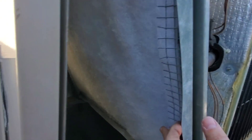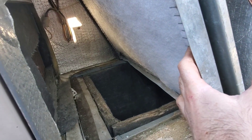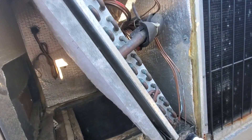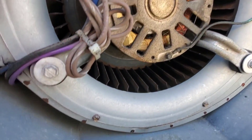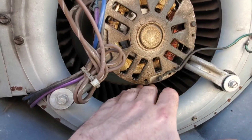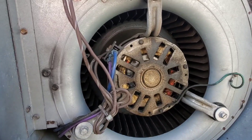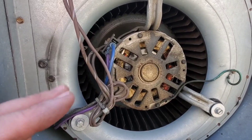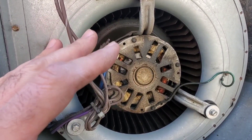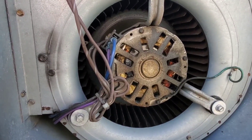Quick check on the filter — looks like it's been changed recently on this machine with filter media, so the filter is clean. I shut the fan down to make sure the blower was running in the right direction, and it was. This is a very important step in troubleshooting, because I've seen blower direction fool a lot of people into thinking there's other things wrong when all it was was the blower running backwards. Very important to check on any call that includes airflow.